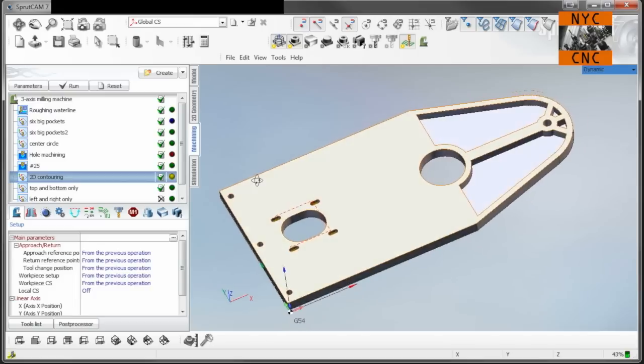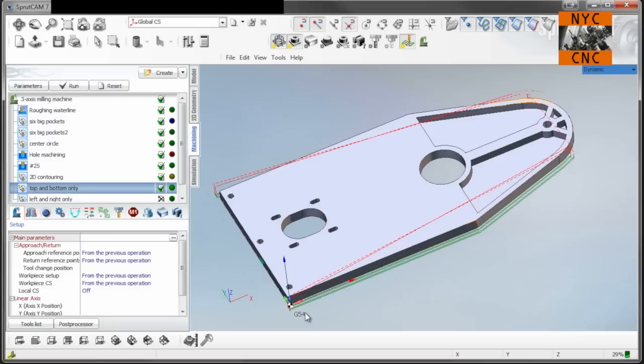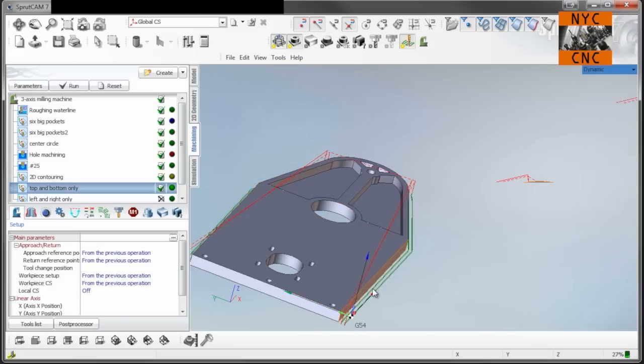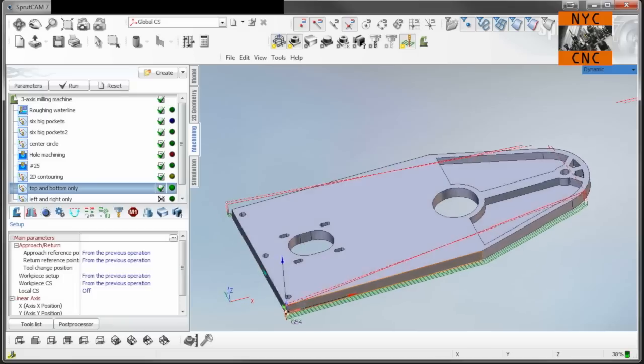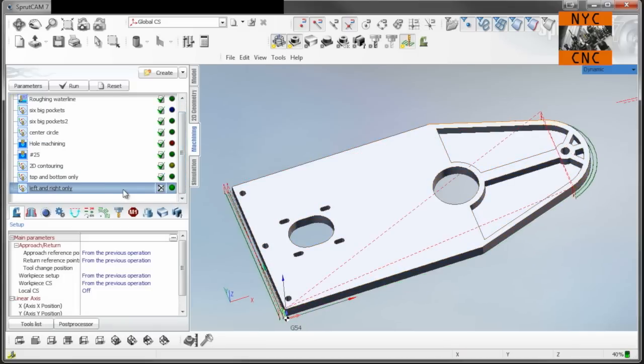And then what we're going to do is finish milling the top and the bottom side. So we'll take a roughing pass and then a final dimension pass all the way down so that that will be totally free and clear. And then finally, we will swap our clamps, and then we'll come back and run the separate CAD file with this last op, which will separate the part this way.